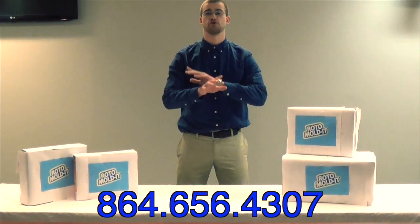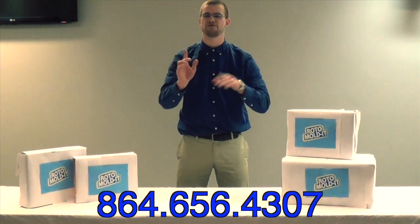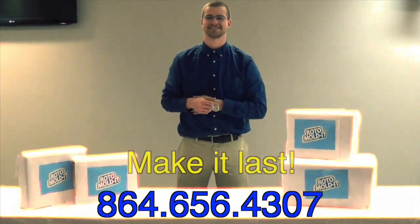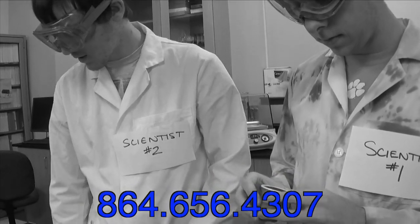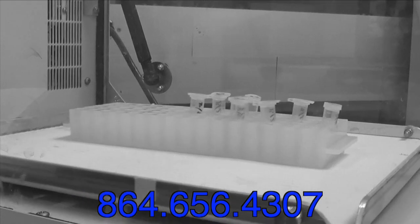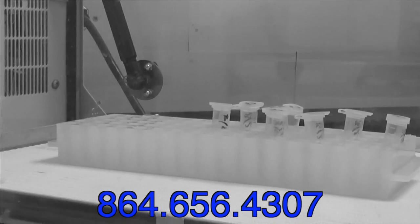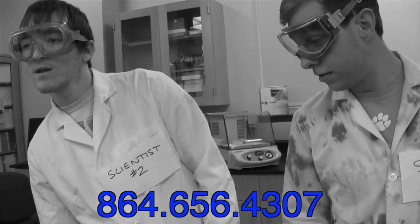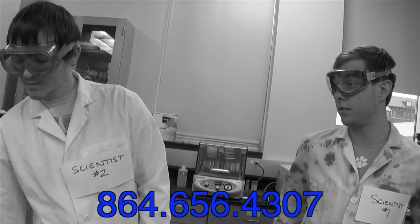Using state-of-the-art breakthrough Roto-Molding technology, we've come up with a method to make something hollow fast and make it last. Many years of scientific testing have formed this method so that it's a low pressure process that puts a polymer powder into a mold onto two perpendicular axes. The mold is sealed and rotated and just like that you have an amazing product.